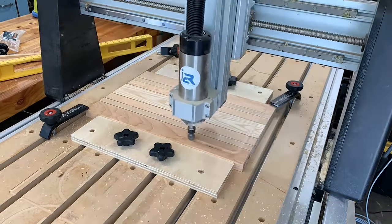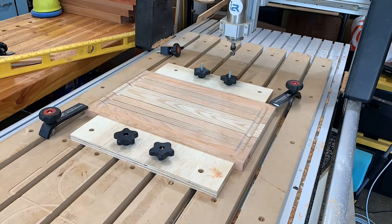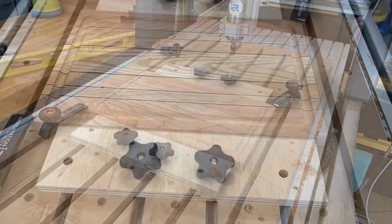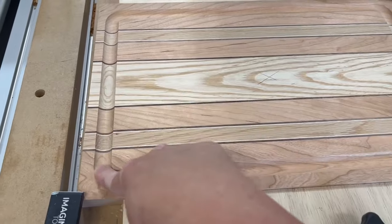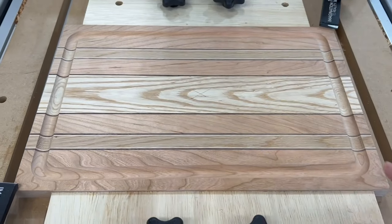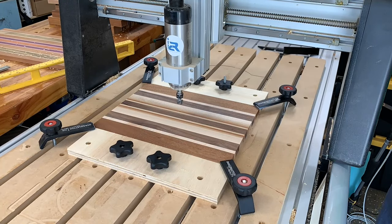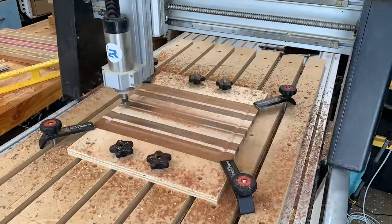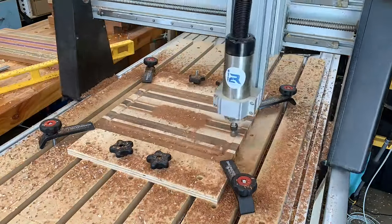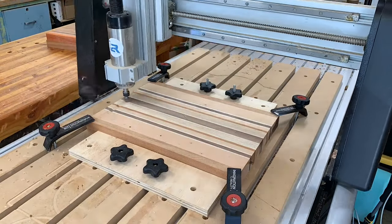Double-stick tape alone is not enough. Here's a pretty straightforward juice groove — just a quick rectangle. You can see it's locked down. You've got to make sure the board is held down nice and secure. Here you can see there are four hold-down clamps and spacers to lock it in place front and back, which produced some great results.